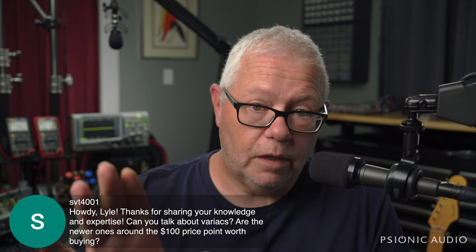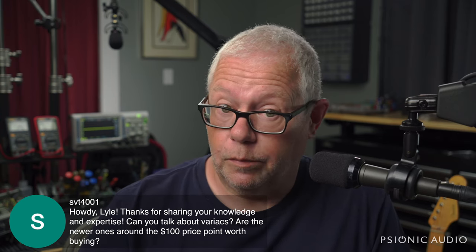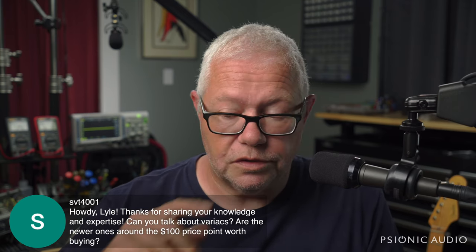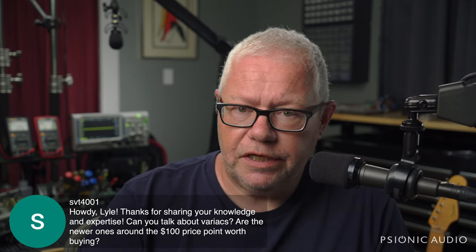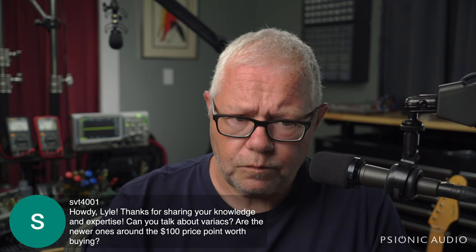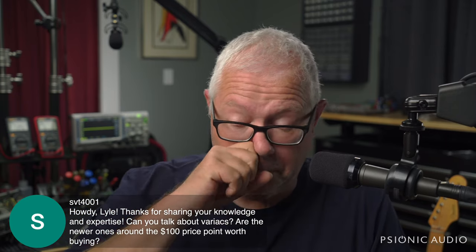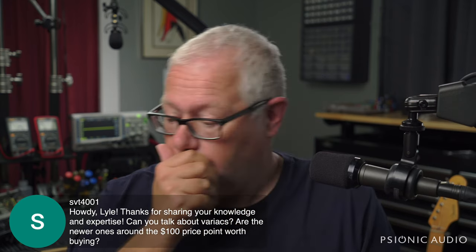if the current capacity of the transformer, the variac, is up to what you're going to be powering it with. A 5 amp will do most guitar amps just fine, but if you're doing an SVT, you need a lot more, et cetera. The main issue I have with the ones that people tend to get, which are like the red ones from China that Parts Express, et cetera, sell, is that the knob is never calibrated. So it's set and it says it's 120 volts, but you have no way of knowing that that's what you're going to actually get.